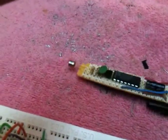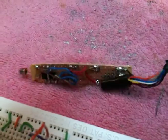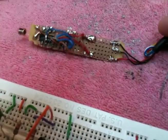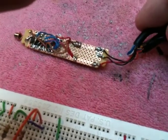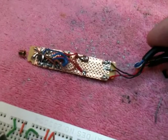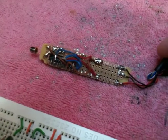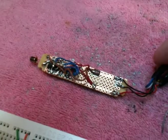And coming into the board from the Vectrex controller, the Vectrex provides +5 and -5 volts at the controller. We're using only the +5 for power. The black wire at the top is the ground, and then the center wire is the wire that does all the work. It senses the signal from the phototransistor and tells the Vectrex that there is light there or not.